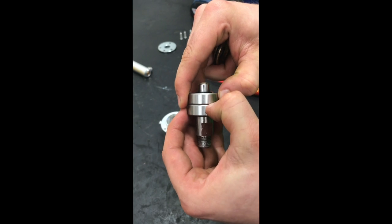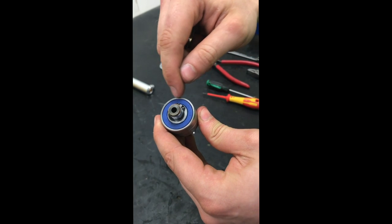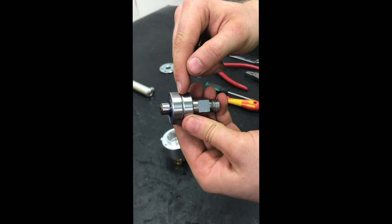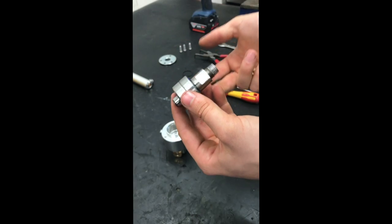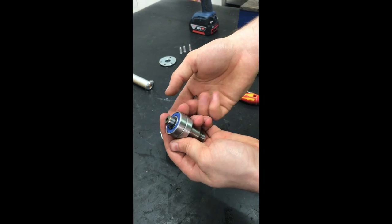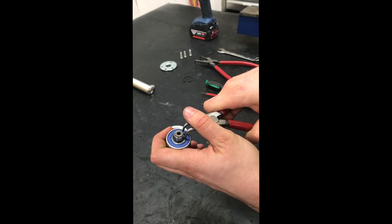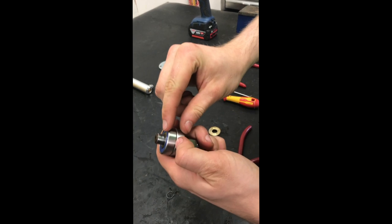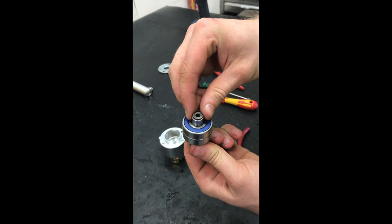As you look at this — where does the grease get into the center of the bearing housings? There's no opening for it to pass through, there's no space here. So what we're going to do is remove the rubber shielding from the bearings to allow the grease to pass through the center of the top bearing and into the second bearing. We'll leave the bottom shield on because it stops sand and grit passing up from the bottom of the unit into the casing. First we'll quickly remove the circlip from the top of the shaft and then press these off in the hydraulic press.